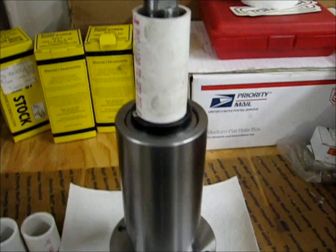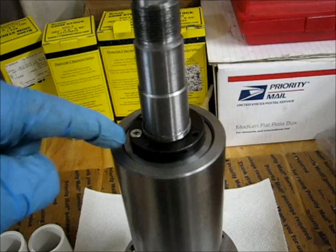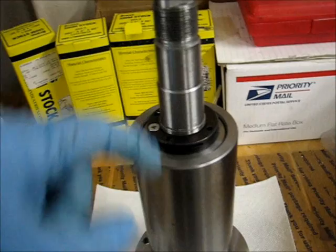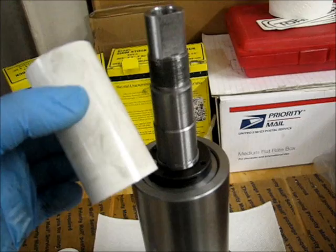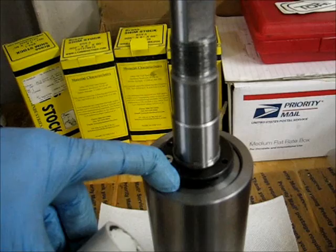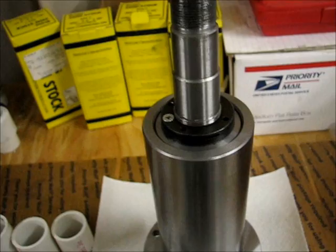Now this system worked fine until I got to the point where the spacer itself was starting to engage with, not the spacer, but the slinger or discourager was starting to interface with the part of the shaft that was passing through the bearing, and that's the part where this is a close fit. As soon as that started happening, as I was tightening the nut, the PVC was spinning with the nut and the slinger ring, because the two were loose and essentially able to do it, or maybe the PVC was sliding across the top face of the nut. At any rate, as soon as the slinger ring started to engage with the shaft where the bearing is attached, things started to slow way down because the fit was preventing the rotation. So I was actually having to slide the nut across the top surface of the PVC, which was increasingly more difficult.